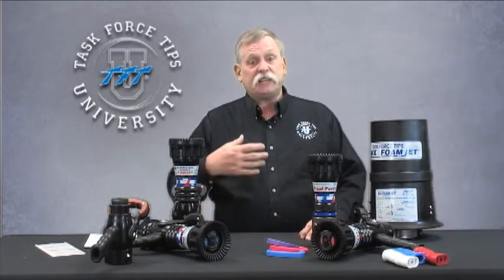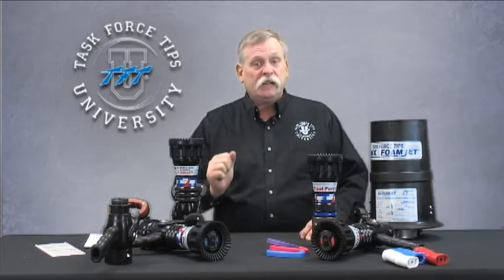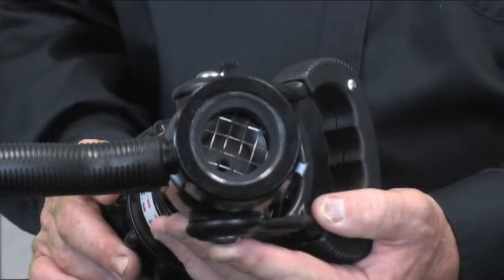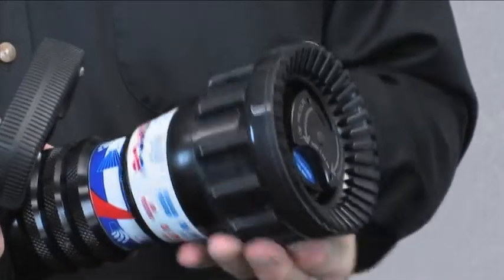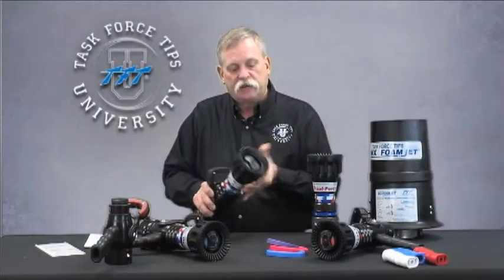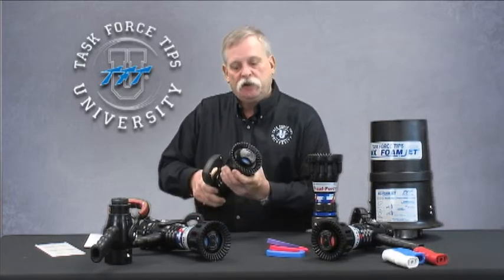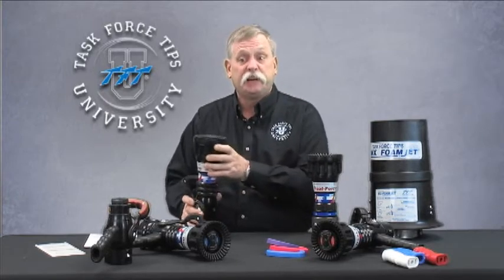The slide valve gives absolute nozzle and flow control — that perfect stream gating the line up and down. Each nozzle also comes with a debris screen on the inlet to prevent any debris from getting up in the head and affecting the fog pattern. Something else typically unique to TFT is what we call the quick straight stream to fog pattern — one hand motion all the way from straight stream back to a wide protective fog, never having to take your hand off. You can also go directly into flush without ever having to shut the line down, very quickly getting back if you do manage to get debris in the line.